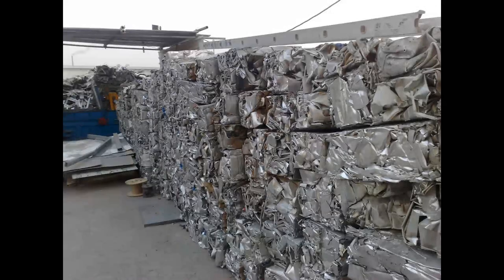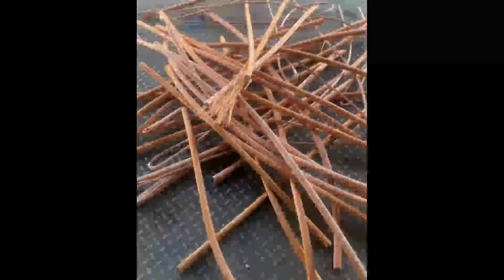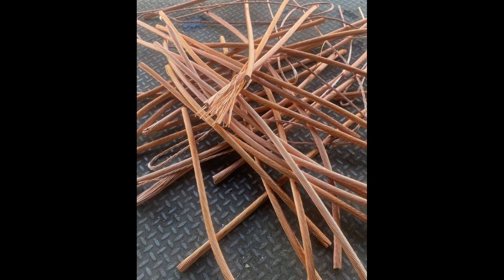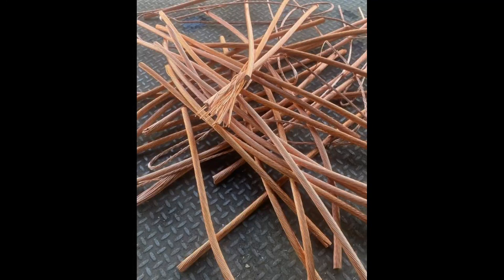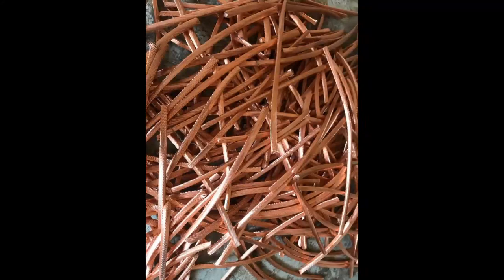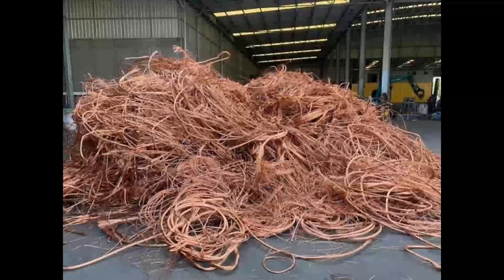2. Precipitation with another metal. To precipitate aluminum from the solution, a suitable metal such as zinc can be used. When zinc is added to the solution, aluminum ions can displace zinc ions, leading to the precipitation of aluminum in a relatively pure form. 3. Drying and powdering the aluminum precipitate. After precipitation, the aluminum precipitate can be dried and further processed into crystals or powder for subsequent steps. 4. Melting and casting. The resultant aluminum powder can be introduced into a crucible and melted in an ordinary furnace at high temperatures to form an aluminum ingot.